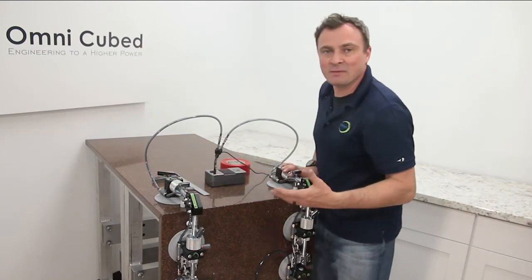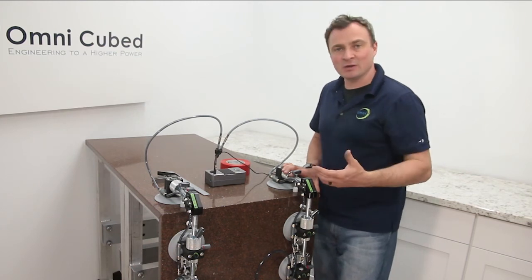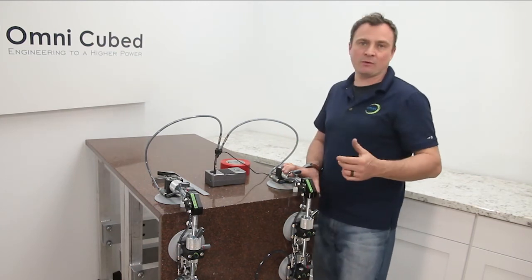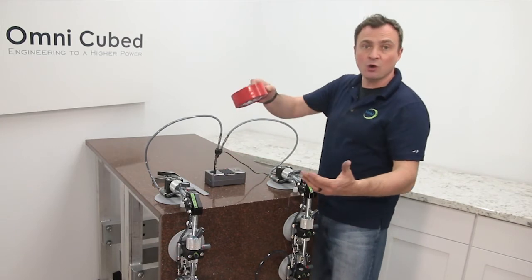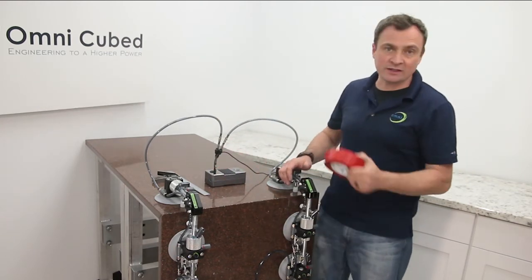Now, this is a miter joint. So just like any miter joint, you're going to want to use tape for a little extra pinch force right where you need it. Maybe there's a little bit of bow or crown in your stone, and tape is going to do that. It's going to pull it together and hold it tight while the adhesive kicks.